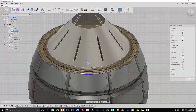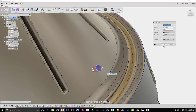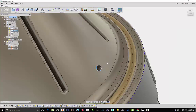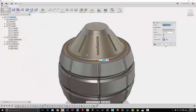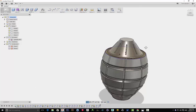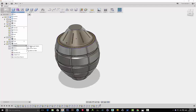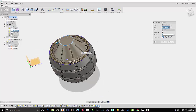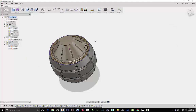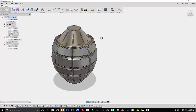I'm creating a center diameter circle, selecting my sketch, and doing an extrude. Just like what we did earlier — applying a fillet and then going to the pattern function — I'm going to be doing the exact same thing. I'll go to the Create menu, Pattern > Circular Pattern, making sure I select the fillet and the cut as my objects, and the axis is going to be that circle. Inputting the value of 8 times around — you guys can go ahead and play around with that feature.